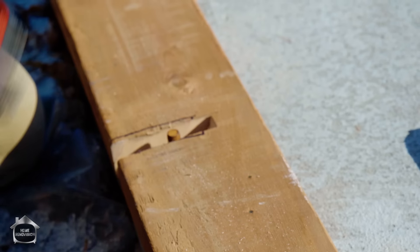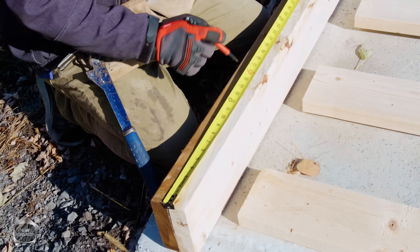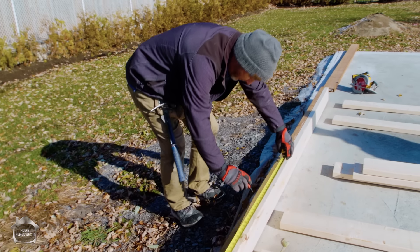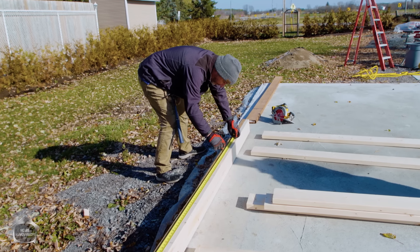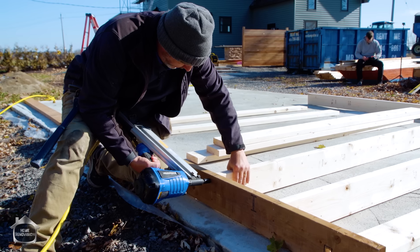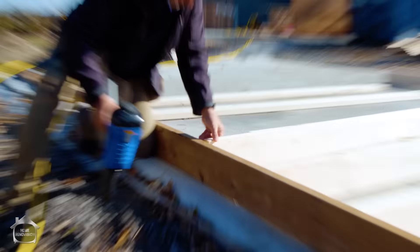The process of building a wall is really as simple as taking your bottom and your top plate. I use these DeWalt tapes because they have a red square on them — that literally means that's where the stud is. I'm going to have a stud here and I always mark on the left, running across and marking the top and bottom plate at the same time. Then we can nail this all together. One nail for every two inches of dimensional lumber — two by six makes three nails.